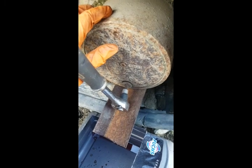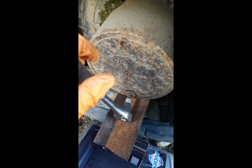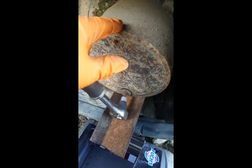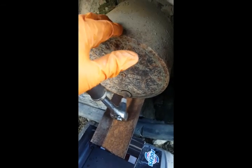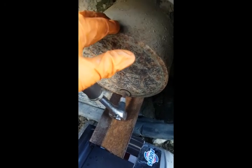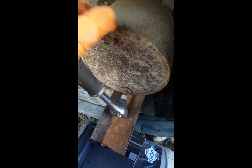To us, the biggest fault with buying a digger second hand is that these might suddenly stop working, and you come to open them up and there's no oil in them, and hasn't been for years. So it's important to check these. I took this off to check it had oil in it, and now I'm going to change it because the oil is quite dirty, but this is quite an important thing to check.